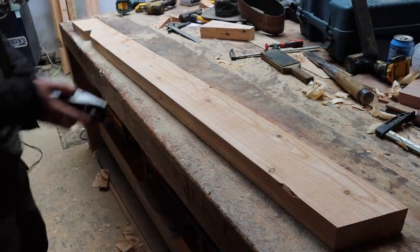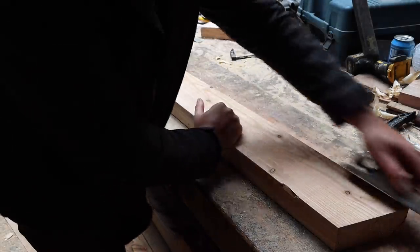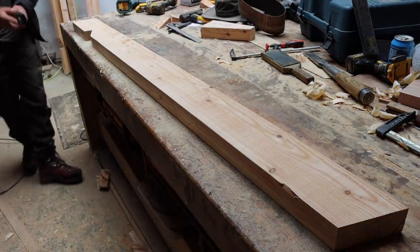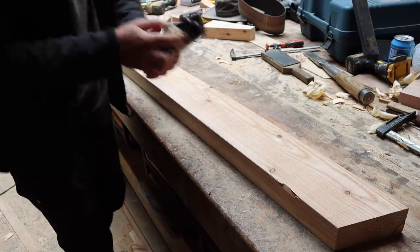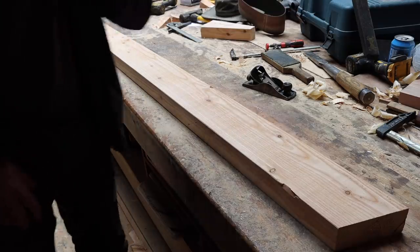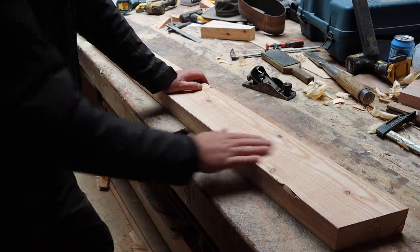A few people asked why I went with the frame in the middle type design as opposed to the original reciprocal design. One is for that height, but it could have been done with a reciprocal roof if I'd gone high on the walls, which was another aspect. But one of the main factors was the difficulty in getting timbers long enough. Some of those timbers would have had to be over 8 meters long, like the ones down here were, and it was a nightmare getting them. They'd have to come on a lorry, and the ones I used didn't. I could just put them on a small trailer. So that was the main reason: timber length was much shorter and easily movable without big lorries and things.